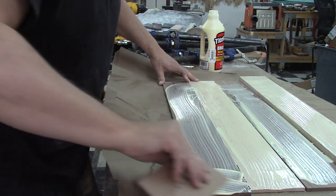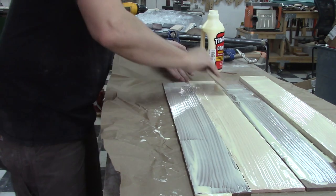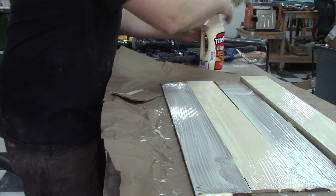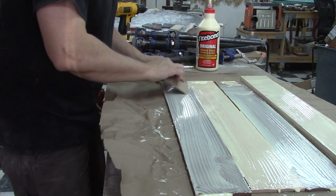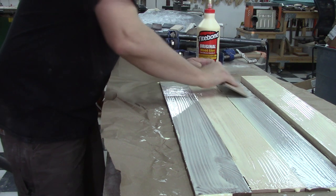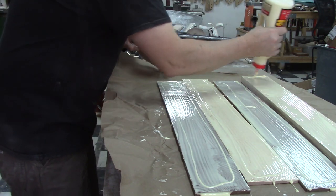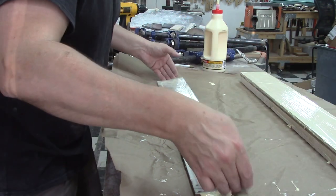There are lots of ways to do this, so if your dad does it a different way, I'm not saying he's wrong — this is just how I do it. We want to make sure we have enough glue and get everything nicely covered. When it's hot, guys, you really have to work fast to get your glue spread. So if you're working with a bunch of laminates like we're doing here, move with haste. We got some trouble spots on the ends here that don't want to get glued up — we'll get those sorted. Glad I put that paper down.